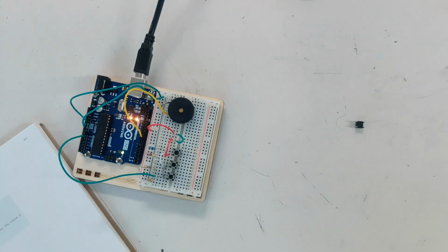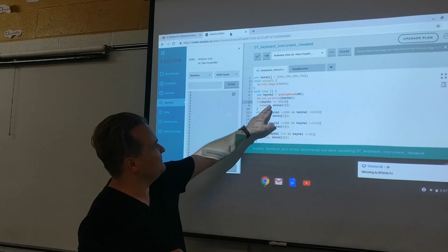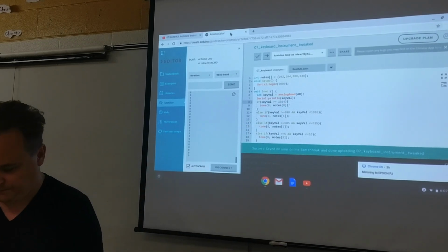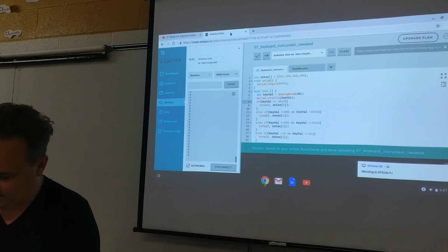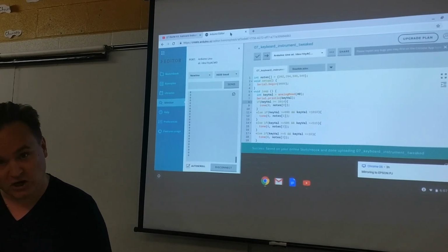So you can see it's a little weak. So I changed my code. I'll take that out. I changed my code, instead of being equals 1023 here, I said greater than 1014. I made up a close number because the next button has very little margin of error here.